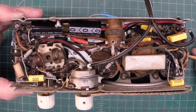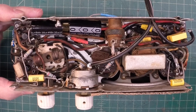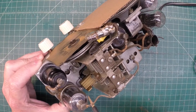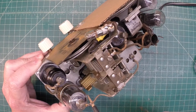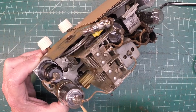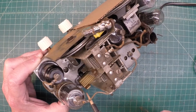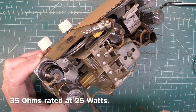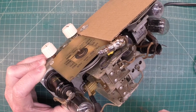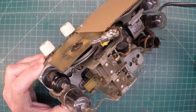Let me flip this over and show you where I hid the power resistor and diode. As you can see, there was really no room underneath to do so. If you go back and look at the little Cadet radio I just completed, I'm using the same voltage-dropping scheme. The tube complement being the same, as far as the voltage drop on the heater string, I actually used a 35-ohm power resistor here as well. The diode is placed down here, tucked in, right underneath on the top side of the tuning condenser.